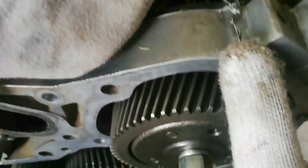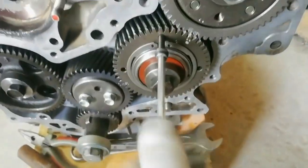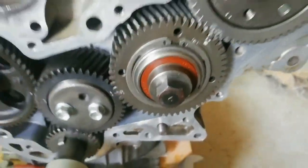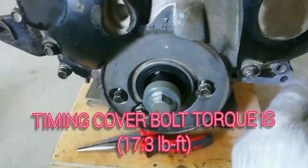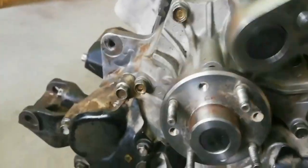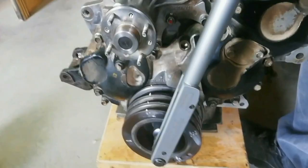Tie with steel wire to hold the injection pump while installing the timing gear cover. After setting the injection pump idler gear with the same timing gear mark, pull out the gear tension holder bolt. Install the timing gear cover with a bolt torque of 17.3 foot-pounds.